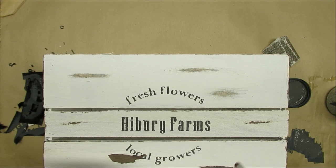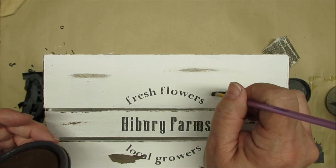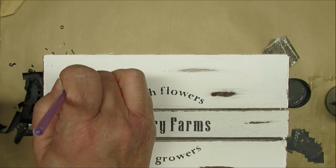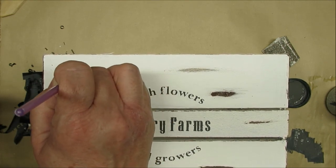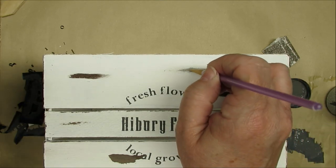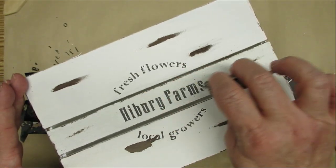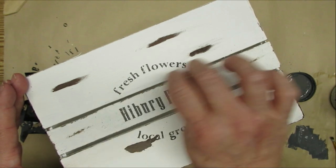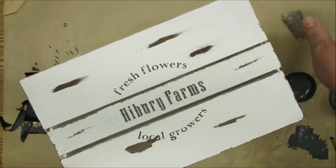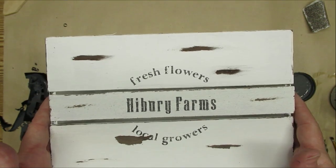Where I painted the brown on the shim and on the bottom piece you could see that brown color coming through, but where I sanded on the top where there was just the brown stain, it wasn't deep enough. So I just took a little brush and some of that brown paint and went over it so it would look the same as the distressing at the bottom. I also sanded over the letters a little bit just to give them more of a faded look — it got a few little scratches through them and it made it look more in tune with the rest of the crate.